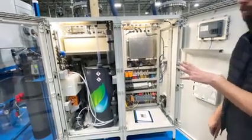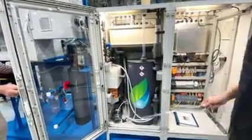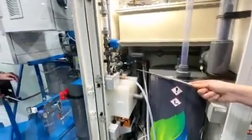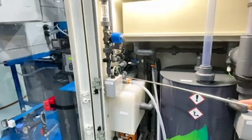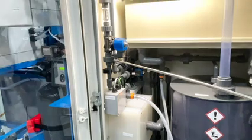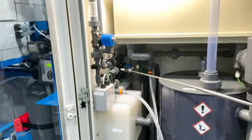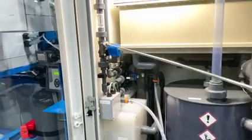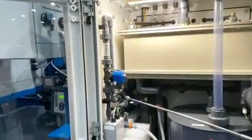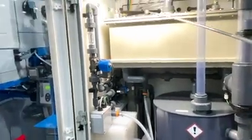So if we look a bit closer at the production cabinet, then we start with water coming in. So over here, the softened water supply is coming in. And then we meet this T section where we divert into this solenoid valve and into this solenoid valve. That solenoid valve is opening and closing to fill the brine tank. This solenoid valve runs through a flow regulator and then into this flow meter into the back of this cell.